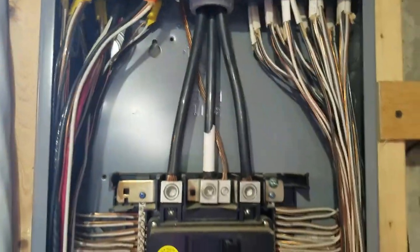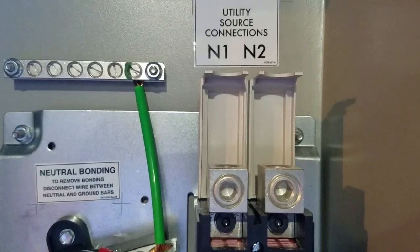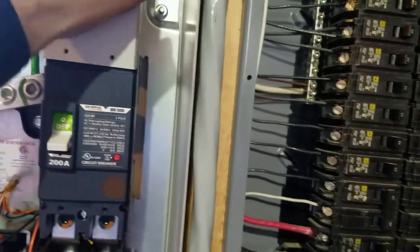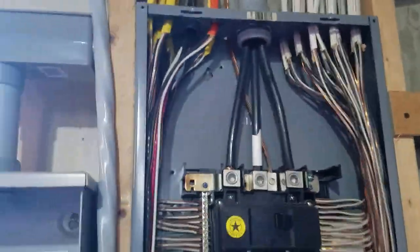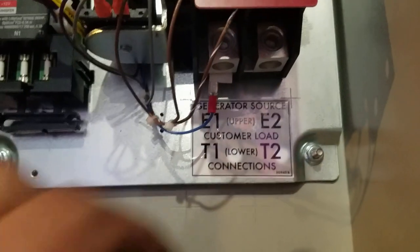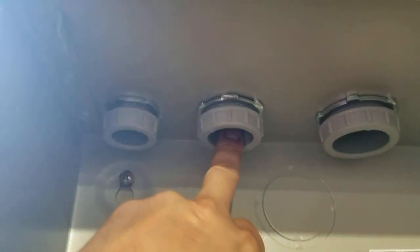Up here at our feed — I've got to redo this. This one will come down, go through, come down, go through there, come down, and it goes to the utility source — the top two lugs. Then come down to the bottom, customer load, T1 and T2, go through here, down, through here, and it'll come up and go around the side into there. Then come down to the generator source on these back two leads, and it'll go up to here. It's going to be a number four wire because it's only 100 amps.